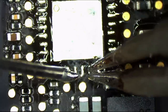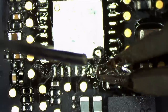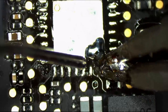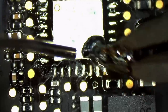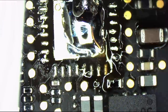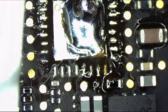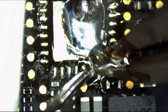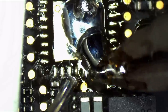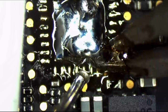This is a question I get a lot, Louis. Why are you soldering on top of corrosion? I'm not. You may see me doing this constantly. I'm scraping, scraping, scraping. What I'm doing here is scraping to make sure I get rid of all of that junky, rusty-looking crap, and I want it all to get collected on this solder blob on my iron. Because this really hot solder, the flux is going to help that happen. There's flux in the solder, and as I'm moving it back and forth and scraping, I want all that nasty crap to go onto the iron itself, onto that blob of solder.